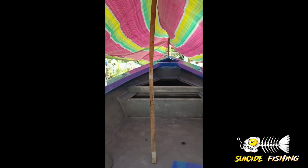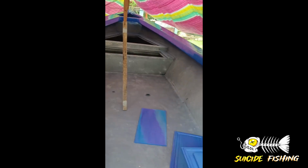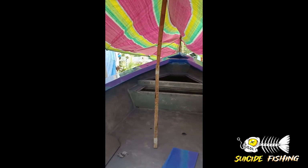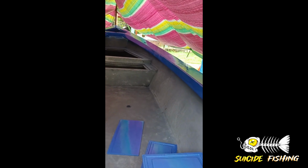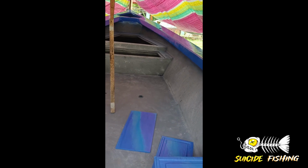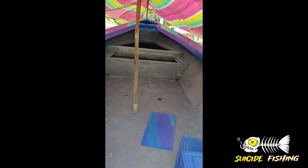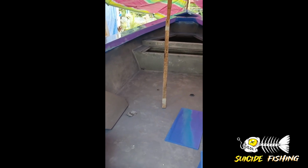Anyhow, I think it's official. We used 120 liters of epoxy resin for the fiberglassing, and I'm not sure what that equals out to. 40 gallons maybe? Yeah, approximately 40 maybe, or 30 gallons of epoxy. And we've kept track of it because we want to make sure we know about what the boat weighs. But for a flat bottom, I still believe this is originally designed for just over 800 pounds, with double fiberglass on the exterior. And what we've done is we put additional plywood on the interior and fiberglass, and we fiberglassed the floor.